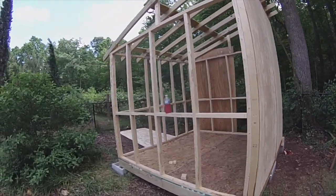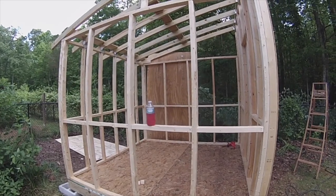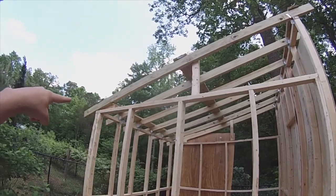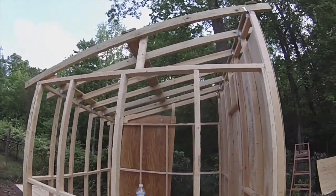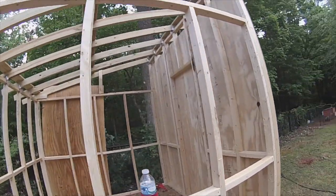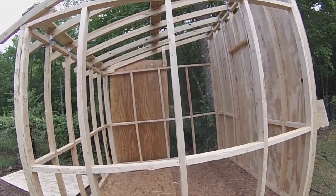So what we'll do tomorrow is I got to break the saw out and cut these pieces. I think I'm going to cut right to this first 6-foot wall and then do a second piece up there. I got to cut the door out yet. And I think the goal is to get it all T111'd.